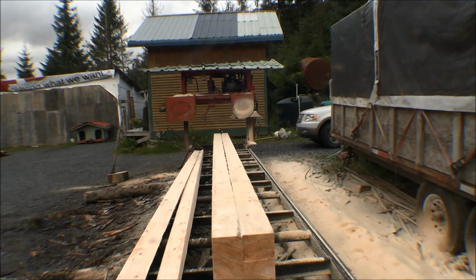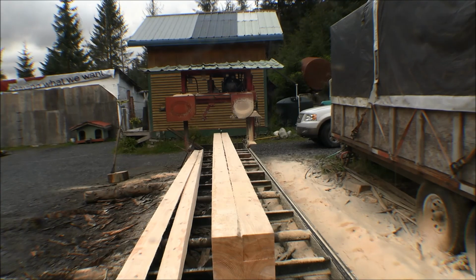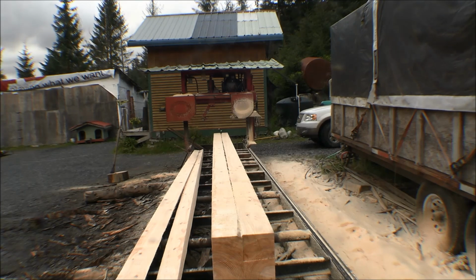Now, normally on a shed, you might put two bys or one bys or whatever like that and space them out on 6 inch or 12 inch or something like that, spacing in between it and put a metal roof on it. But this is going to be a closed in space on the loft area, dry storage space. And if you just have metal roofing up there on top of skip sheeting, then the condensation forms on the underside of the metal roofing just normally, and it'll drip down in the building and it'll be wet. So I'm going to put a solid roof deck up on there, and then we'll put tar paper or something like that on top of that, and then the roofing on top of that.